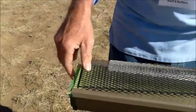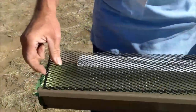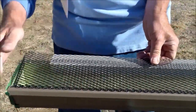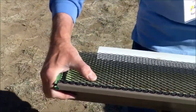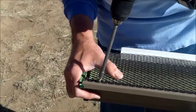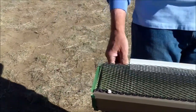This kind of screen — the front lip of the gutter has to fit in here and it has to go all the way in tight. We're going to shove it over tight against the end cap, take a drill, put a screw right in there, and now we're sealed.